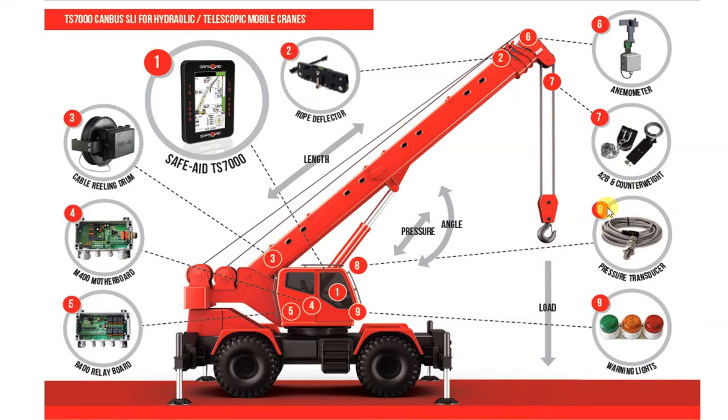The pressure sensors, or pressure transducers. A pressure sensor, or transducer, is a device used for pressure measurement of liquids, more specifically hydraulic oil. It generates a signal as a function of the pressure imposed, usually millivolts or milliamps. In crane applications, they are used to monitor the pressure on the boom cylinder, more specifically rod and piston side pressure, to produce a load output or reading on the load indicator in the operator's cab of the crane.